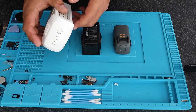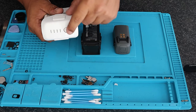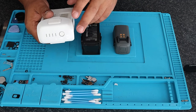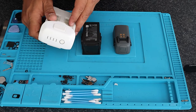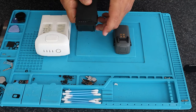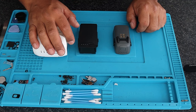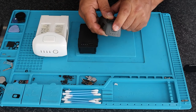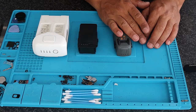When these batteries are flat, they usually flash at least one light to indicate they are flat. When it flashes none, that means the battery is in fact faulty. There are a couple of potential faults that can only be determined after opening, plugging in, testing with a multimeter, a power supply, and some software. As you can see — absolutely nothing. That tells me there's no life in these batteries. You can plug these onto a charger for a year and they're not going to come back up. All 100% dead.